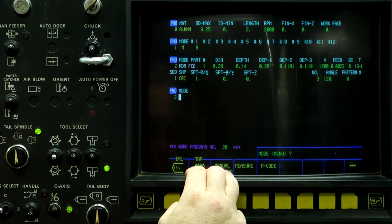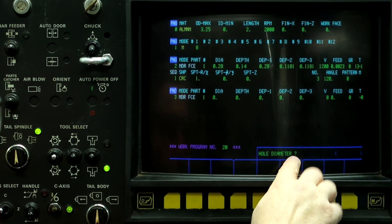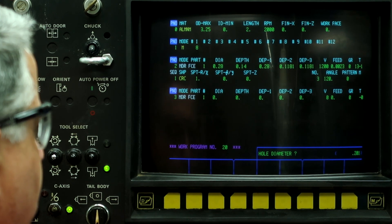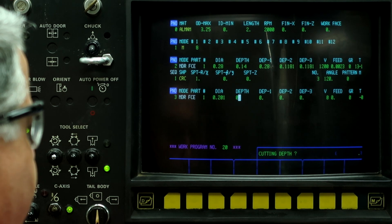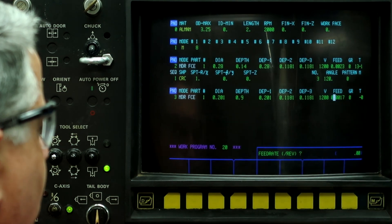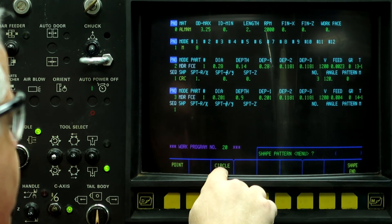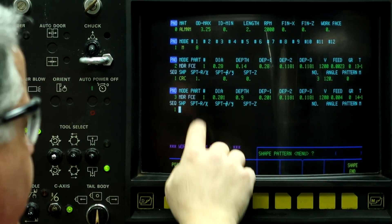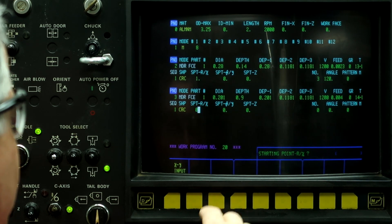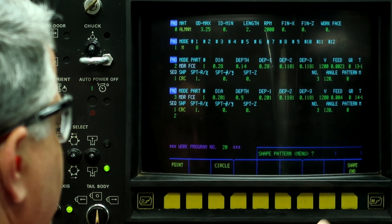Now we're going to do milling drill, face, number one pecking. The hole diameter for a quarter-twenty is 200 thousandths, so 0.201. Cutting depth, we're going to drill 900 thousandths deep. Auto on the feeds and speeds. We're going to kick the feed rate up a little bit to four thousandths. This is tool 14, offset 1. And we're going to do the same circle pattern as above so that we drill into the spot faces. Circle — type in the same values as above. Shape end.